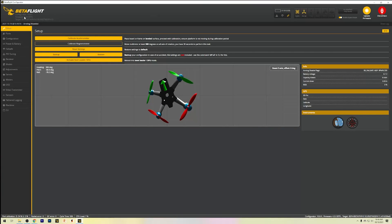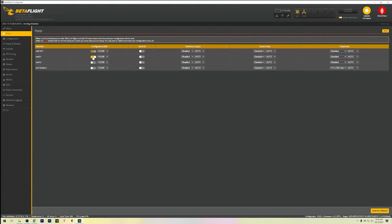Looking at Betaflight, it's running Betaflight 4.3.0 nightly. On the ports tab, UART1 is for MSP. There's nothing set for serial RX because SPI receivers don't tie up a UART — they are directly connected to the MCU, which makes them lower latency than having them over a UART since there's no decoding going on. A key thing to mention about ExpressLRS over SPI: the firmware for the ExpressLRS receiver is carried in the Betaflight firmware code. So to update your ExpressLRS receiver on this, you don't do it through the configurator — it just gets done when you update Betaflight, as opposed to UART-based boards where you'd update it like any other ExpressLRS receiver.